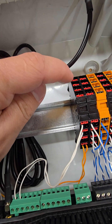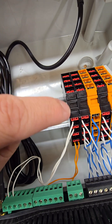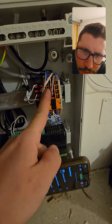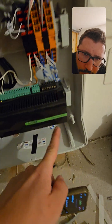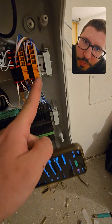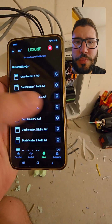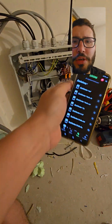I have twice 24 volts here, and then the two lines coming back for the magnetic contact. The cables come in here — I've put the blue one there and the blue one from the other window here, and it switches the blue to those colors. I've just put all the relays in the config to press them and see if I have them all in the correct order.